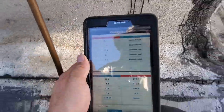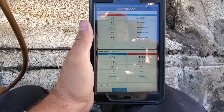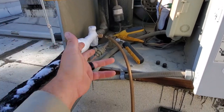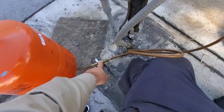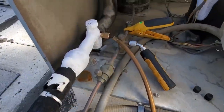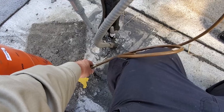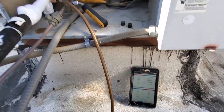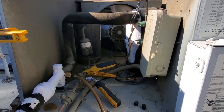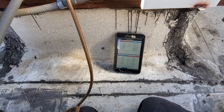We are still flashing. Box temp is about 5 degrees now. Almost no sub-cooling. So we're going to go ahead and add some charge. I have my hose with a low-loss fitting on one side and a ball valve on the other. I weighed my cylinder before I brought it on the roof so I can find out how much refrigerant I used. We're going to proceed to clear the sight glass a little bit at a time, working the ball valve. I've got a suction probe all the way down at the evaporators measuring the true evaporator superheat. Obviously we're flooding back to the compressor because we've got really low superheat, so I do want to be careful.